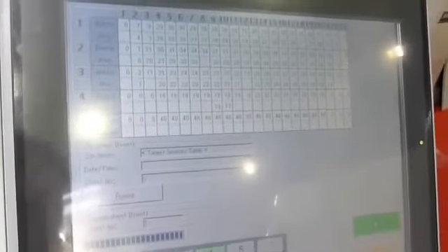Close loop now — so now we're going to use the closed loop. Go ahead, Paul, and you'll see the adjustment take place across there. You'll have before and after figures. As Paul was describing, the observed readings from the X-Rite are sent seamlessly through the console to the individual ink keys on the Sakurai, and then it even displays the before and after settings so that you can easily track that.